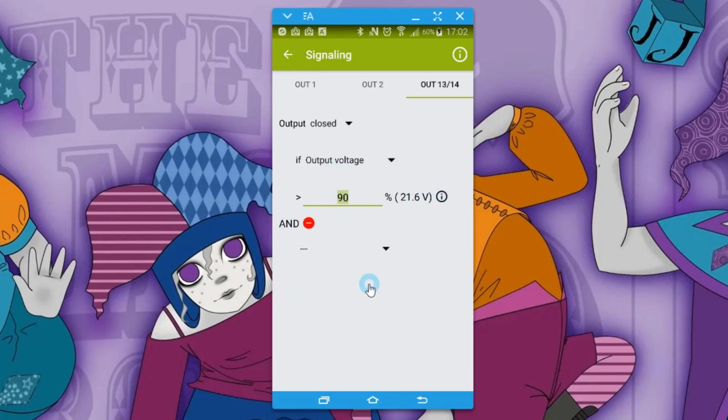So overall, these QUINT4 power supplies, they've got quite a lot of adjustments. They've got the ability to lock out the front panel control. They have the ability to participate in preventative maintenance by providing you operating parameters on effectively a real-time basis that you can feed into trend analysis and everything else, and look out for deviations from the norm that could then trigger a maintenance visit to the system, so that you can figure out why it's drawing more power or less, and remediate that and fix it. So I think that's probably about everything right now that I want to show you with these Phoenix Contact power supplies. You do pay a lot more for it.